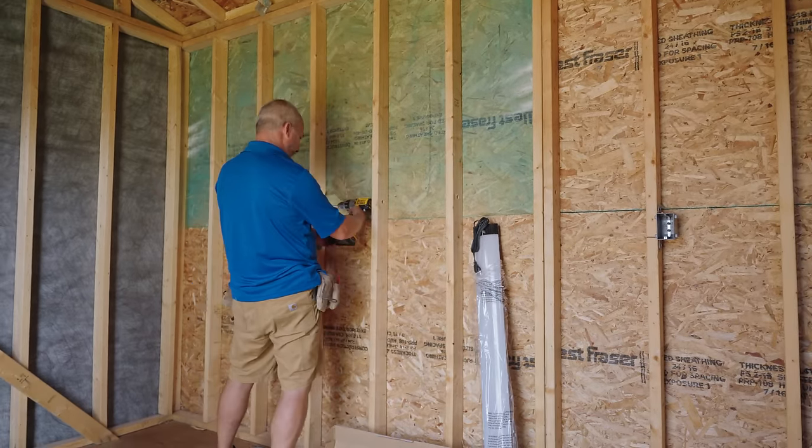Okay. And we'll leave that there for now. There we go. Now what I like to do, guys, is I like to actually run my wire, put my switch or my plug on, then start working my staples to the next box, okay? So I never have to worry about, did I get it all, right? I'm gonna continue, complete every stage one step at a time.